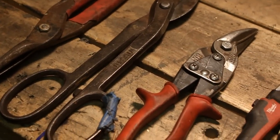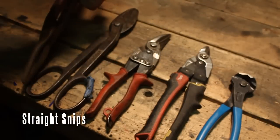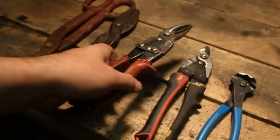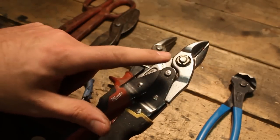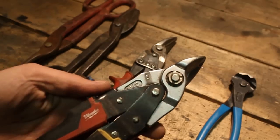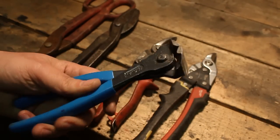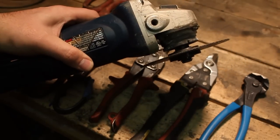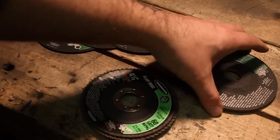As far as cutting goes, this is really what I use. I do it the old fashioned way, but my next purchase will be a Beverly Shear or a Throatless Shear which will make this so much easier — check that out on the site as well. These are regular aviation snips. These here are bulldog snips, sometimes called bullnose snips. The fulcrum is different so you get a much smaller beak but a much easier cut — I love these, they come in very handy. These are called end nippers; I use these for cutting off nails to make rivets. Also for cutting you can use a handheld grinder with a cut-off wheel, and you can switch them out to use regular grinding wheels as well.